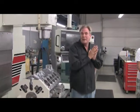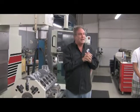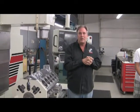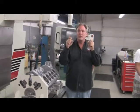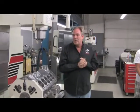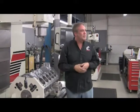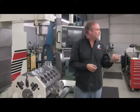It doesn't need any welding rod. So you never want to run two parts of a similar metal at high speed against each other, or they melt into one because their molecular structure is similar, and they want to bond. They want to fuse, okay? So you normally would have an iron bore and an aluminum piston, but now that you have an aluminum bore, you have to have an iron piston. You have to switch them.